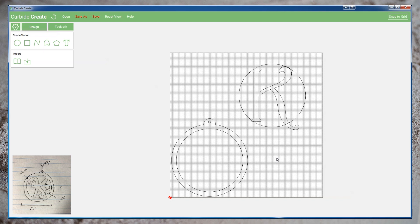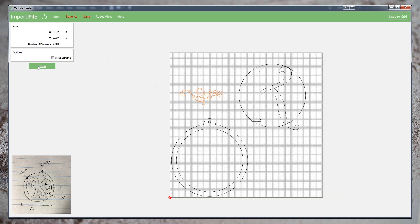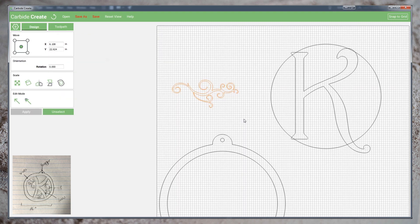Next, let's look at how we can add a vine embellishment to this. I've chosen to import an SVG of a vine shape that I already had. In another video, I'll cover how to convert JPEGs and other types of images into SVGs that you can use, but that would make this video unnecessarily complex. So for now, I'll use the one I already have. I'll continue by using the scale, rotate, and move tools to move several copies of the vines into the profile so that they intersect the edge and the letter in a way I find interesting. I'll be careful to always leave a few points of contact between the vines, the letters, and the profile just to make sure pieces aren't as likely to fall off.